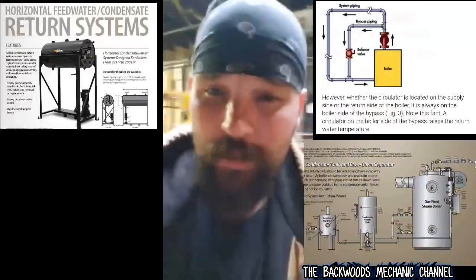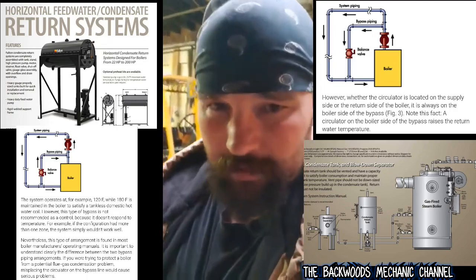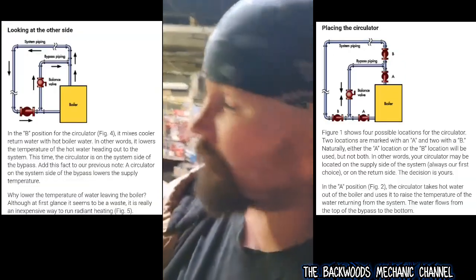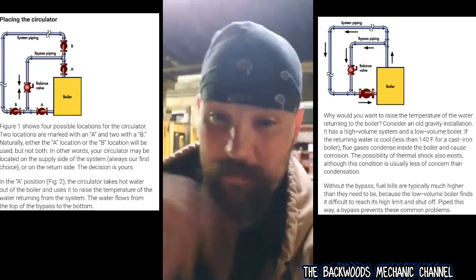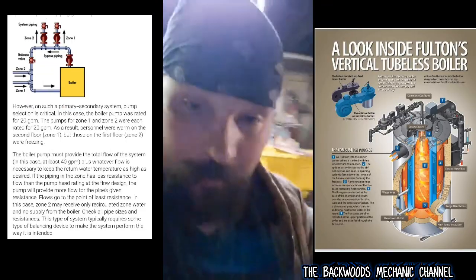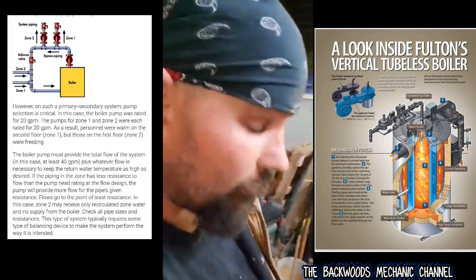We traced the return line all the way back, shut some valves off, then tried to relieve pressure off that line so we didn't have to shut down the equipment - there was no other cutoff valve. We cracked open the return tank line to circulate the water out, and then the tank started rumbling - you could physically see it move. So we shut the valve right back off. I really didn't want to get blown off that ladder from a water tank, which is why you stay cautious and maintain good communication with the people working around you.